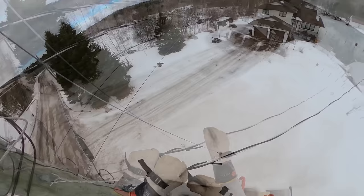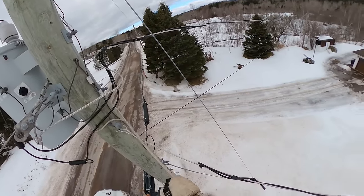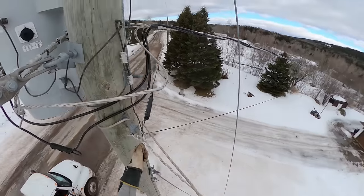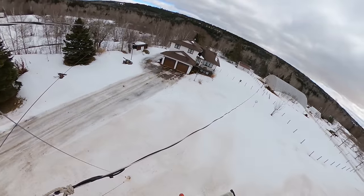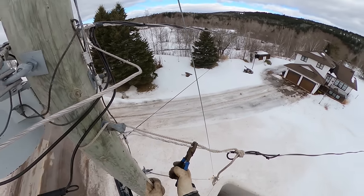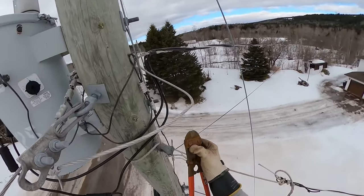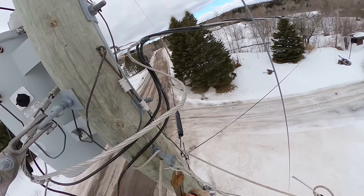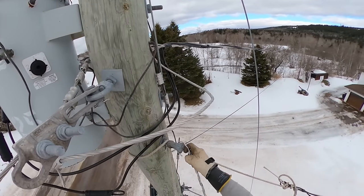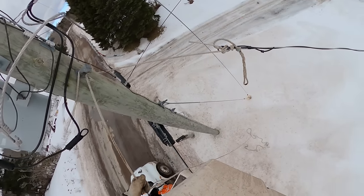The wind noise is getting a bit too crazy so I'm going to turn down the volume and start doing some voiceover. Basically I'm making a fat spot in the wire so that when I take my rope and make a knot it's not going to slide off the end. If this were triplex or anything that wasn't manageable by hand I'd definitely be using come-alongs. This duplex number four - I'm holding hardly five or ten pounds with my hand, especially the way I've got it wrapped around the pole. I configured the rope so I can retrieve it right from the ground without having to go back up in the truck.